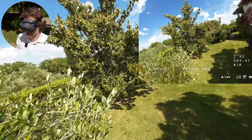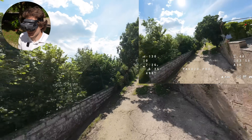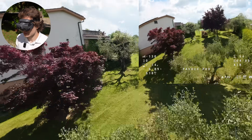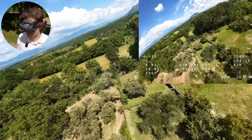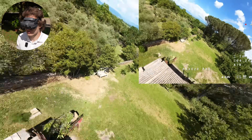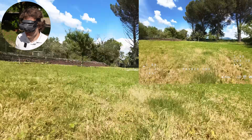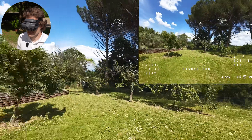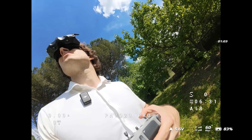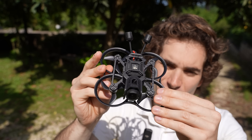It's very hard to drop the voltage because the battery with these motors is super efficient. I want to check if the O4 turns off if you throttle too much, because that's something that can happen on 2S drones — and maybe that's another reason I would not advise you to run 2S on this drone. Just use the throttle limit. It's not made to fly 2S, don't do it. As long as you fly level it works kind of fine, but these motors are pretty efficient at 2S. With a 1000mAh 2S you're gonna do probably 8 minutes of flying indoors, even 10. I tried dropping the battery voltage below 5 volts in my hands and the camera was still on — it has a nice battery eliminator circuit. Whatever happens, you're gonna remain in control of the camera.